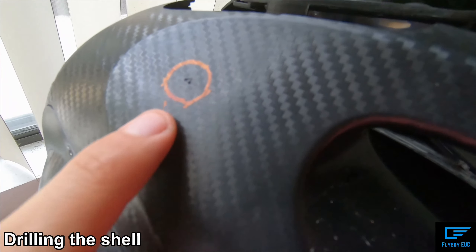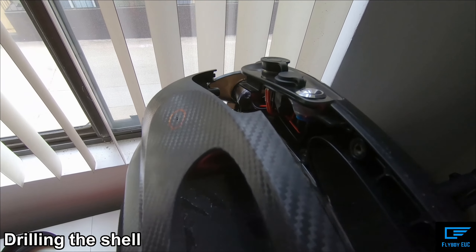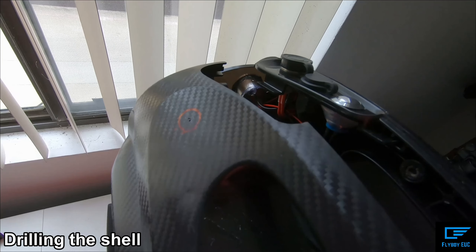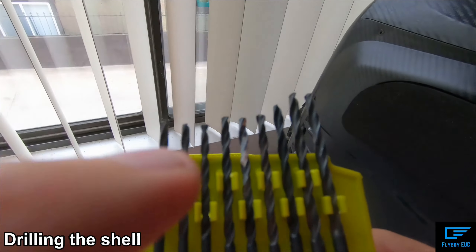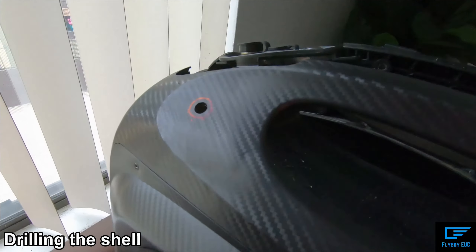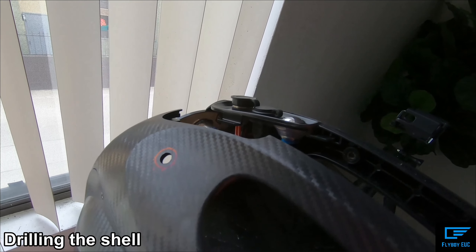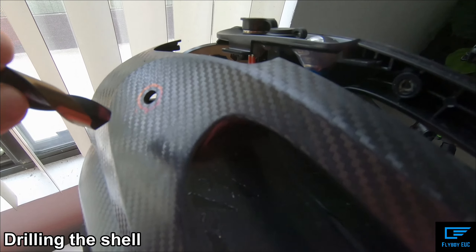I've marked my little hole and done a little center punch. I'm probably not going to film the drilling because I don't want the pressure of drilling and I don't want to be critiqued on my horrible drilling. So I'll drill this and come back. I'm using a step method — I started out with one of these little drills, just under an eighth inch, to make the pilot hole. Then I used a 5/16ths for the secondary hole, and now I'm doing the big one. If I were to just do this on straight plastic, it would be really hard for it to do the initial cut.